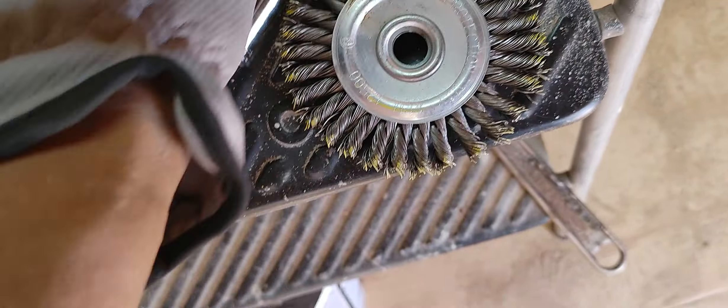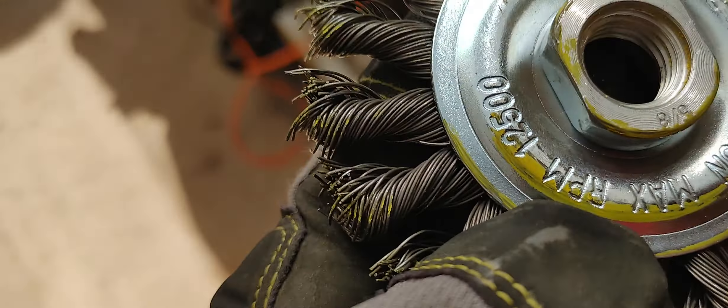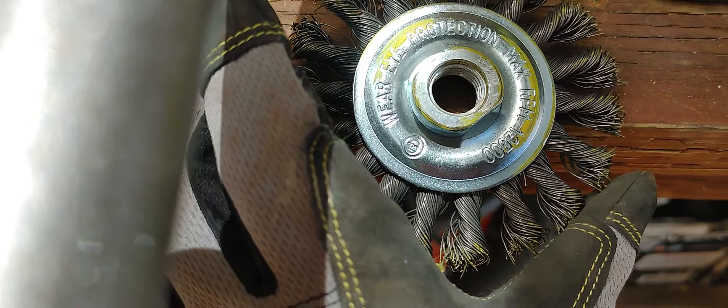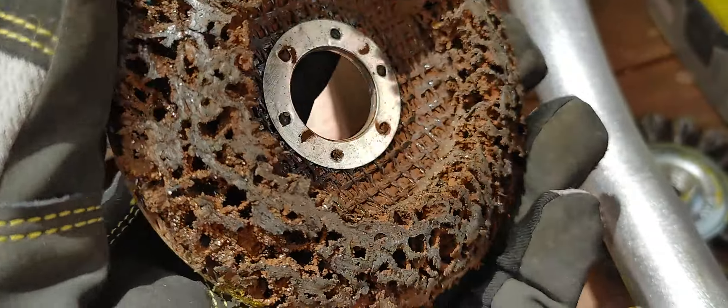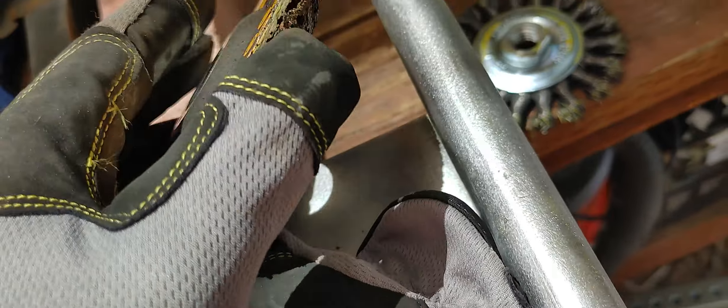The paint was stripped with this heavier duty wire brush — this one has skinnier, more coils. This is part of a set that came with other wire brushes from Harbor Freight. I've been using this to remove most of the paint and it's been going pretty fast. Then I got these pads here — they look like nylon with some kind of abrasive attached, you can see that nylon mesh underneath.